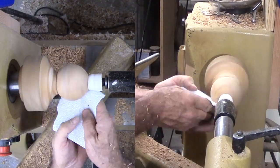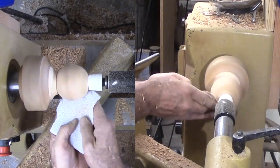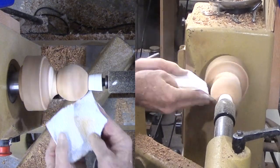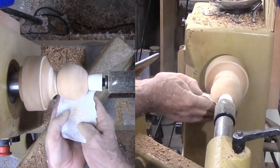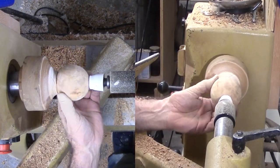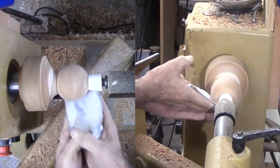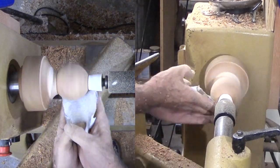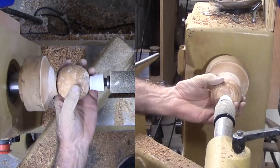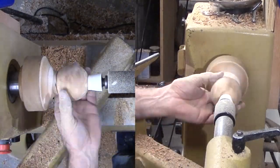My sphere is not perfect but will be shortly. I am changing my tool to 80-grit sandpaper. Do not skip to a higher grit — 80 grit is a great shaping tool to remove any remaining ridges on the sphere. I like to cup the sandpaper to the shape of the sphere. When I was using my gouge, I changed the mount three times; each mount leaves a little at the poles. It is the same now with the sandpaper — I remount and reposition the sphere at least three times. At the 80-grit stage, it is often worth going an extra remount or two to really perfect the sphere. Then the sphere is as perfect as it can be. The only part left is to work up through the grits — three remounts are required at each grit to cover the entire sphere. I do not mark the equator while sanding but I imagine the new equator line and move it from pole to pole at each remount.